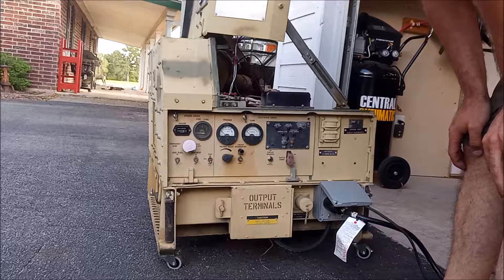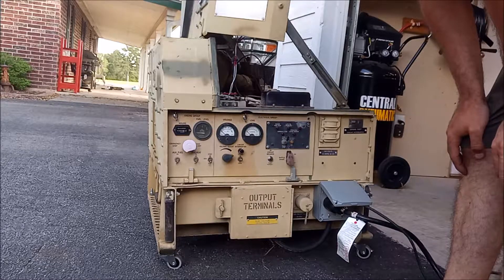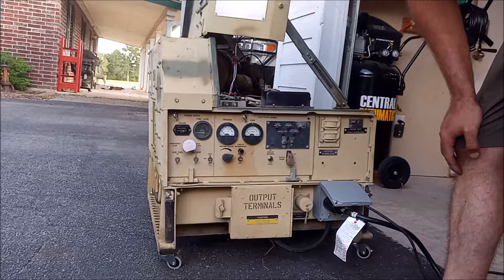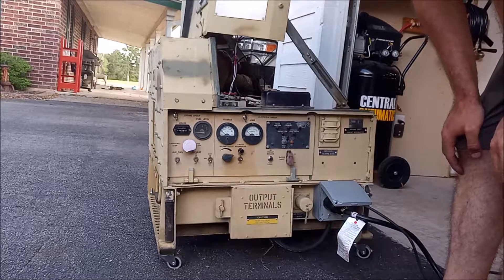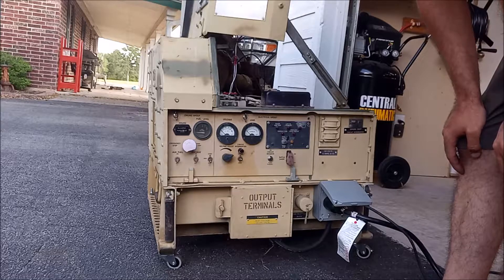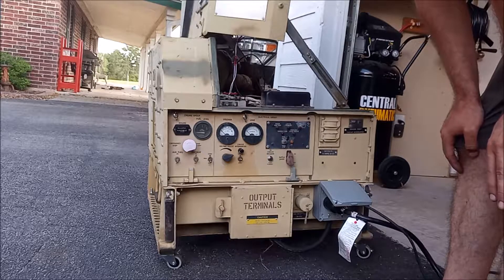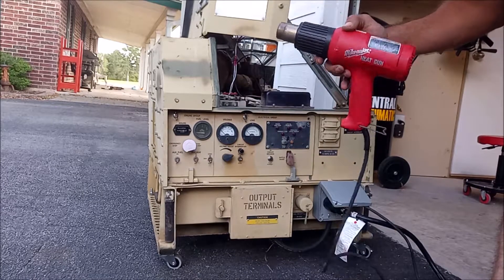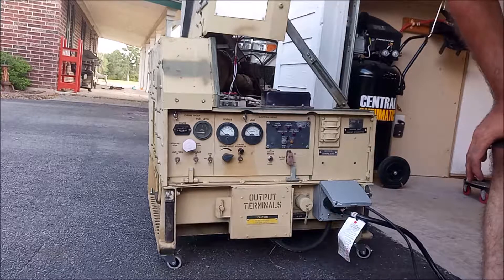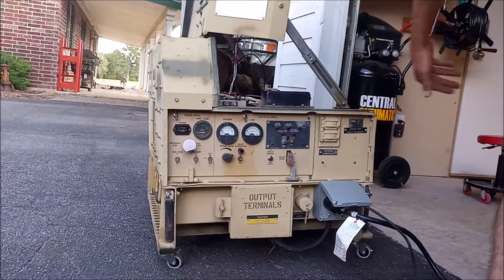I'm going to electric start it — it's already warm because I've been messing with it — but I'll let it idle for a little bit. The first thing I'll put on is a 3,000-watt 240-volt electric heater in the garage. I don't know if it's because I have something a little off on the manual governor, but you can see it definitely strains to start, then comes up and idles fine. After that I'll put my heat gun on low, which I measured at exactly 673 watts — so that's 673 watts over what it's rated, but it will carry it. It does spew out a lot of smoke.